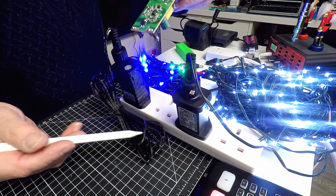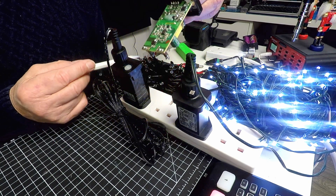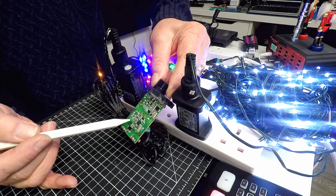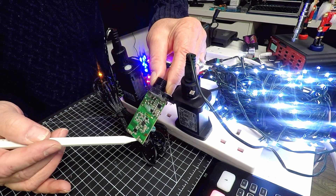These are all two-wire devices. If you're wondering how you can get multiple configurations on two wires, that's how you do it — you switch over the plus and minus on each supply rail. It's quite a neat little unit. The switch-mode power supply converts from your AC input of 110 to 240 volts down to 32 volts.